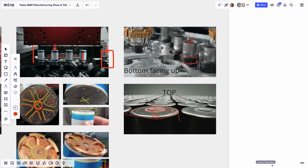So this goes in. The cathode current collector goes into the can first, and once the jelly roll is in here, it would be like here. Of course, the gaps aren't that big, but you have a surface that you need to weld. So you need to weld this to this inside the can. How do you do that? Well, you go through the hole that you left open on the side of the anode current collector. You have access.